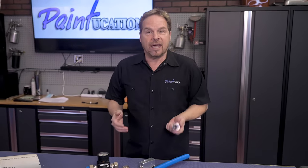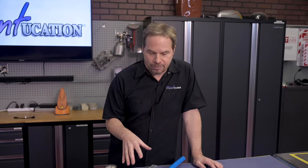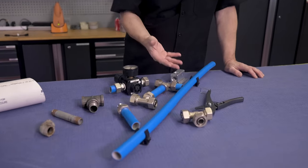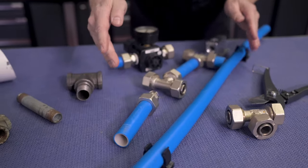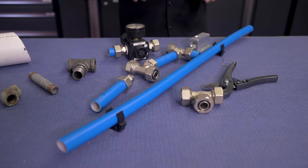This is my recommendation for the best way to plumb your shop. It's not that expensive — especially compared to the downtime from an airline exploding, or contaminants from a black iron pipe ruining a white pearl paint job. If you have the chance to set up your shop from the ground up, or the opportunity to upgrade, go with a modular pipe system. The push-lock o-ring style fitting is just better technology.